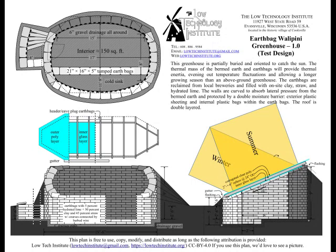It's built up of earth bags, which are essentially clay-filled sandbags that form a retaining wall. Between each layer we have barbed wire acting as Velcro, and we've also driven rebar through them to help make a more stable wall. From the top you can see it's an oval, and the walls are bowed out to help keep the soil from pushing back against it.